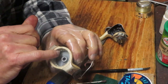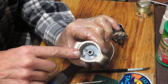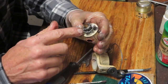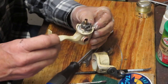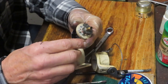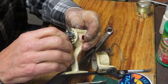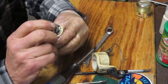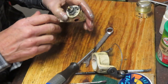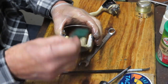Underneath here you can see a traditional anti-reverse - it's got a tooth layer on the inside of the rotor and a dog mechanism over here that causes that. This little tooth here is going to intersect with that when you're backpedaling the reel.